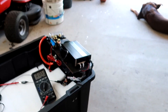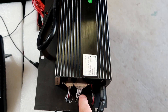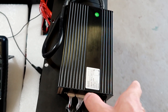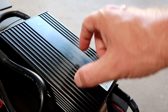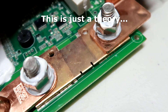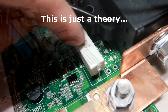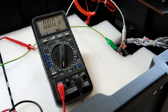It has settled down to just 1.8 to 1.3 milliamps — that is insane. The contactor is not currently turned on; when we put in the balance leads we hear it click on and then click off again — just a self-test. I think what happens is it supplies power to the shunt, and the 10-watt resistor acts as a current sense: if current is very low the relay stays off, but if we push more current through, the contactor will kick in and provide power to the load.